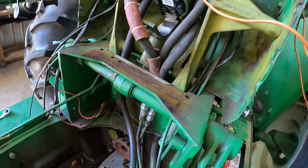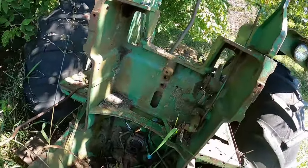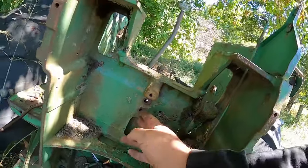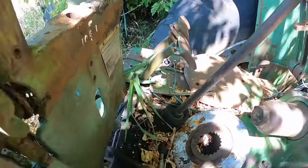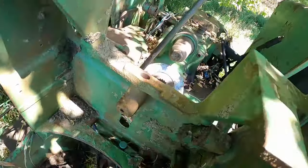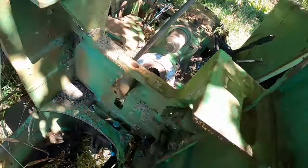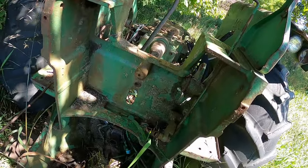Let's go look at the 1850 in the boneyard — I think that may or may not have the pedal in it. This pedal is gone — I must have taken it out for something else. But you'll have two bolt holes here. It holds on a U-shaped steel bracket that the pedal sits in and pivots in, and it has a rod that goes up and your pin goes into the main casting for the dash assembly here. So it could be a little tougher to work on, but easier to get the pedal out.